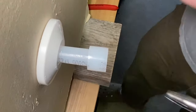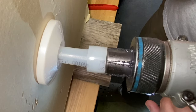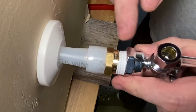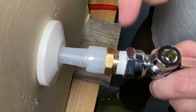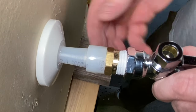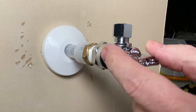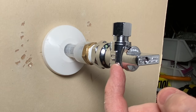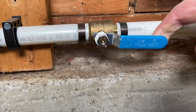At this point we'll be able to take our PEX ring and get this hooked up. Give it about 10 turns, slot the fitting on there — we've already got the adapter and angle stop together. Tighten everything up, put it on straight exactly where you want it, and hold it for about 10 seconds to let it shrink down over the pipe. Now this is all hooked up, you've got a quality repair, and you'll be able to remove the angle stop if it ever fails. Turn your water back on and test for leaks.